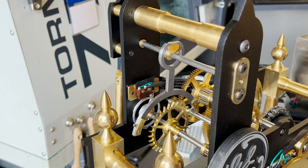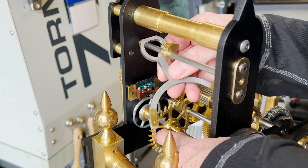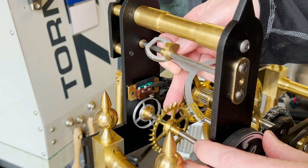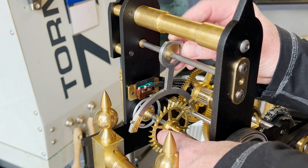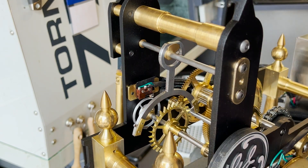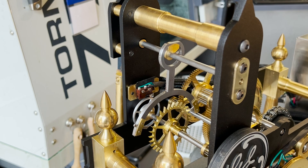You can see it back and working. Another interesting thing is you can actually, with the clock running, remove this — you can see me take it loose, because it's just held with the magnets. There's a little pin there that keeps everything centered. When it's out, this thing wants to run and it's loose, but once it's put back in place it snaps right down, because it wants to be home — it wants to center. Then it's off and just works again, finding the exact home. Anyone who knows how sensitive this is knows it's got to be right on the money, and this works.